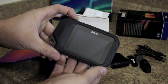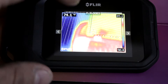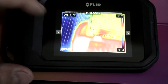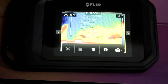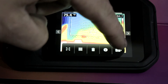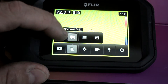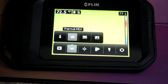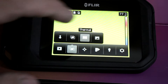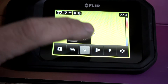Let's fire the thing up and go over some settings and features. The first button on the side accesses images you've taken. Scrolling down gives you a standard picture and then the overlay image below it; you can flip through pictures using the side buttons. Touching the screen lets you go full screen, back to thumbnails, erase, get information about the picture, or go back to the camera. Next is the image mode: you've got alignment adjustment, Thermal MSX — the overlaid simultaneous images — which gives the best resolution and appearance, then standard thermal by itself or digital camera by itself. After that you have the crosshairs or center spot for measurements, which you can turn on or off.